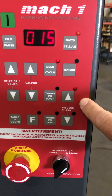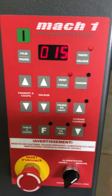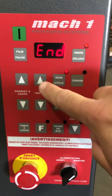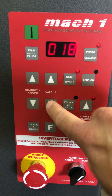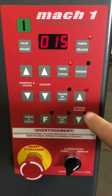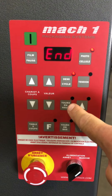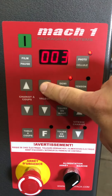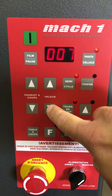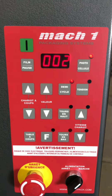These are the carriage up and down speeds. When you press on them it shows you what they're adjusted to — the higher the number, the higher the speed will be. The up speed we can increase to 20, but I'll leave it at 15 for now. Next to the film carriage speed you have the top and bottom wraps. Right now it's set to 2, you can go all the way up to 10. We're gonna bring it back to 3, and you have the same setting for the bottom wraps.